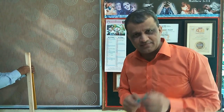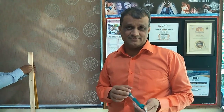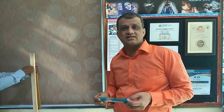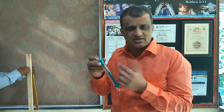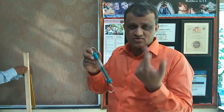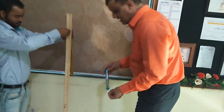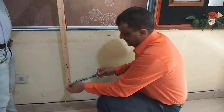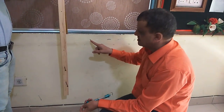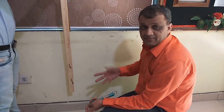In this second part of the video we will see the effect of the angle at which the force is applied on the torque. To measure the force I am using this spring balance, which has two scales — graduated in Newtons and in grams. This is the body, and we will be using just one point. First I will apply a horizontal force to rotate it by some amount, measured by the position of the shadow on this mark, and then I will apply a force perpendicular to the rod.